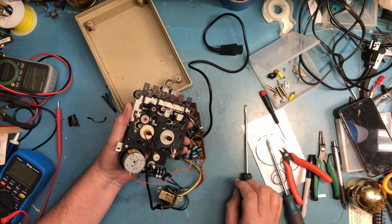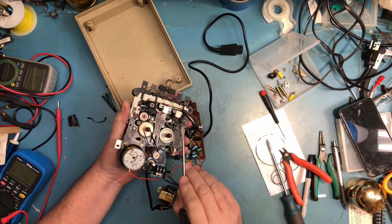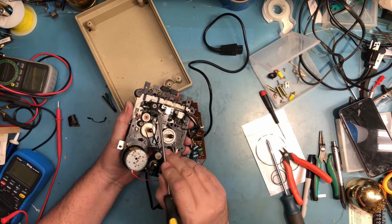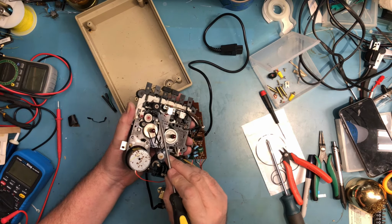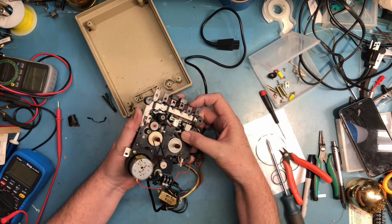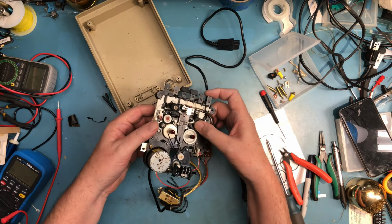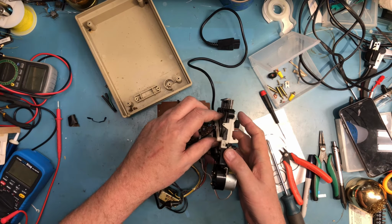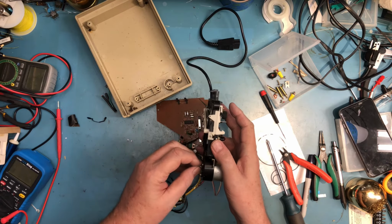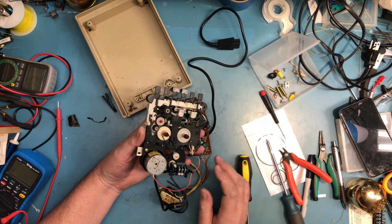I don't have a cassette tape to place in here. The cassette tape is sitting in here. The tape is routed through these two little guides here, across the erase head, across the read write head, through that little gap there, and then comes between this pinch roller and that metal shaft there. And so when you're playing, that metal shaft is spinning, and so it's driving the tape. And the backside, of course, of that metal shaft is this large flywheel. And the mass of the flywheel helps keep the speed constant driven from the motor. And really from there, fast forward and rewind, etc., are just simply getting other things connected.